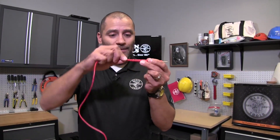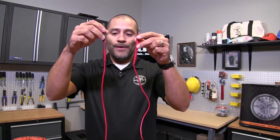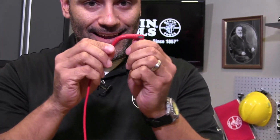The other thing to consider is strain relief. We're looking at the strain relief here at the probe, and the strain relief here at the banana jack. There are a couple of different styles of strain relief, but you really want to look for one that appears durable. Strain relief isn't necessarily most critical at the probe — it's actually more important at the banana side, and the reason really deals with how you store your leads.